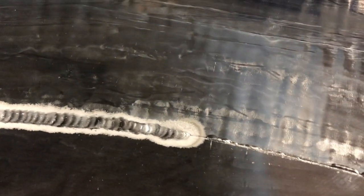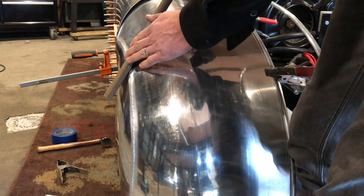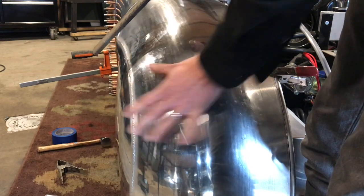So the weld that I initially start with on the other side is just enough to get through and then leave me with a nice setup to come around the backside and give this final weld here. And that really pulls that weld through for a nice penetration, gives you a solid panel. This is where you can see the benefits of having your weld on a high crown point. Really lets you just work a tight area here without affecting your other.